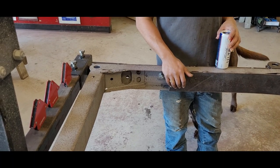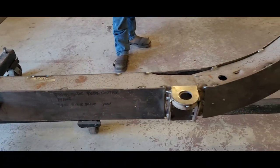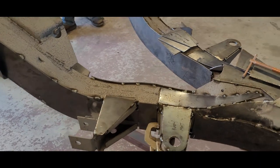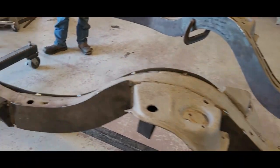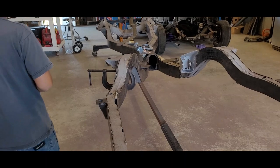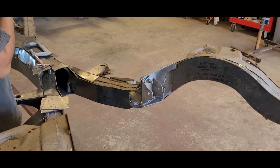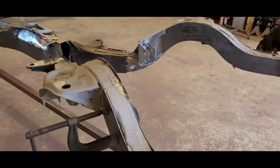For a cleaner look we had to cut it because we forgot about the bumpers. We got the mount down here, the back mount, and the trailing arm. Going to have to make a wishbone bracket - went around it today but eventually that's going to get cut off and reinforced with a custom bracket. Did the pieces as big as we could without chopping the mounts.